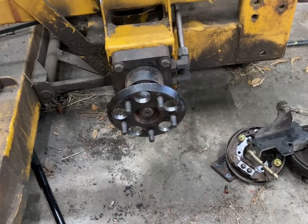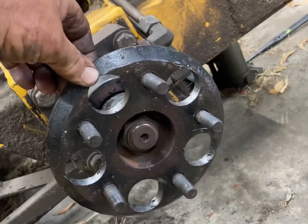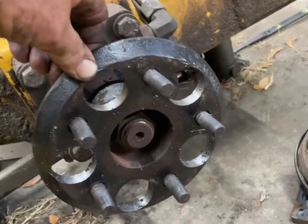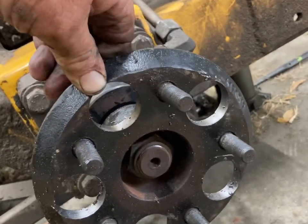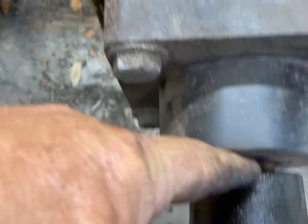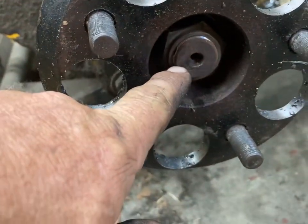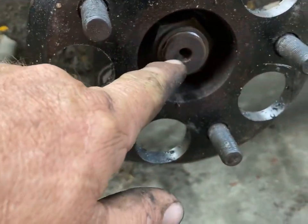So there it is. Now when you put this back on, you're going to want to be sure that that seat's in there really good and that the nut is torqued appropriately — you'll have to look that spec up. The reason being is if there's any play at all, you want to make sure that's the play within the wheel motor, not any play where you would see that shaft. For every millimeter this outside drum turns, you want to see that it's turning there too.